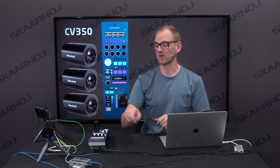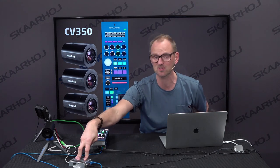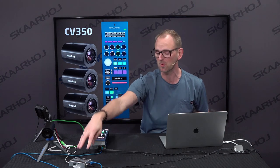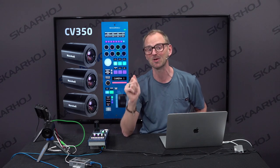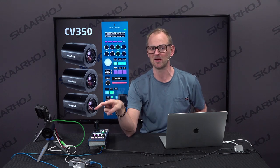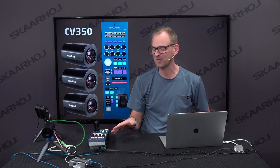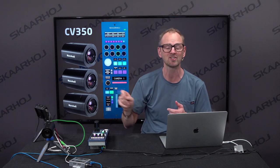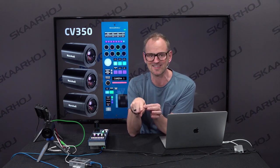For instance, if you had three Marshall cameras on your set. Today we have only one camera, and this camera is a serial camera, so it's connected to a serial-to-ethernet converter. This is how we get access to serial devices, which is really cool because it means you can make that transition point from serial to IP anywhere in your infrastructure wherever it fits you best. The RCP is connected to a POE switch, meaning it has one cable that gives you power and signals.